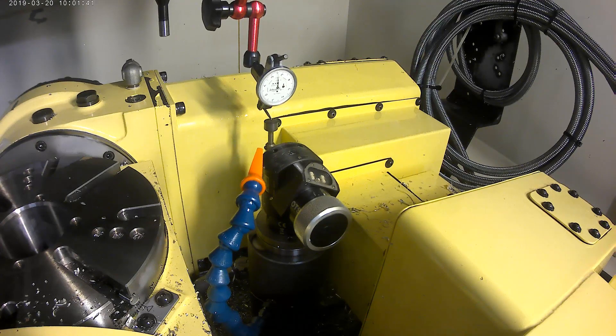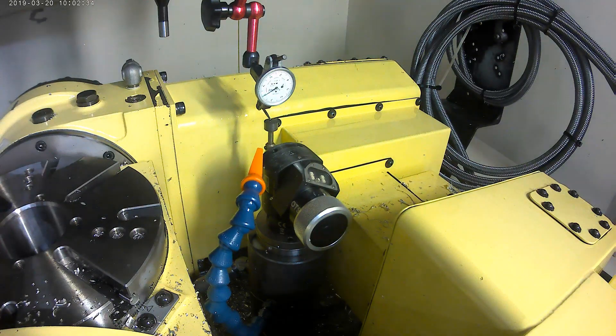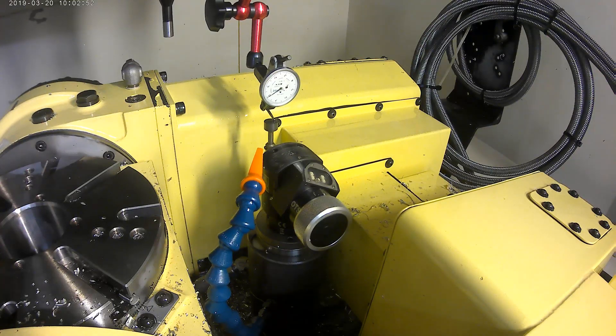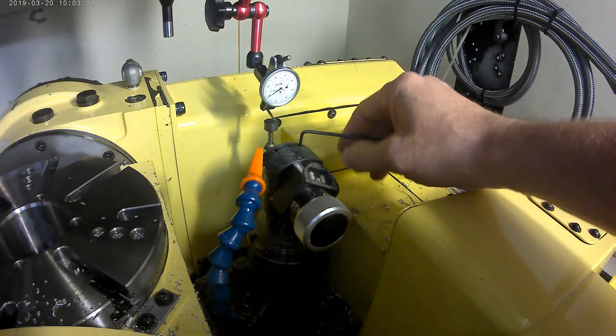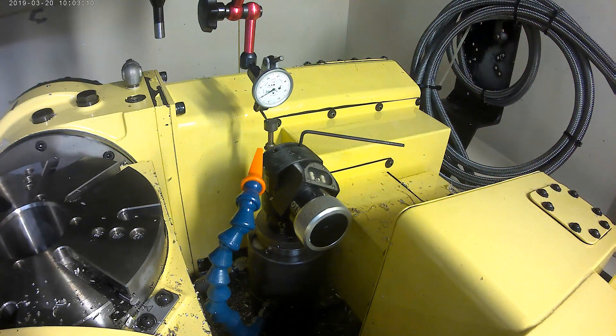Now as long as I have the indicator out I might as well do the same thing for the optical tool setter stylus. This OTS is mounted 90 degrees from what is normal, but it really doesn't matter — I just want to make sure that this thing is flat in both axes. I'm going across the longitudinal axis of the tool setter. There are two socket head cap screws: one that will raise the tip and one that will lower the tip on the front portion of the OTS. I will sweep back and forth across the longitudinal axis of the OTS — in this case the X axis of the machine — and see how flat we are. That adjustment is made with two small set screws similar to the ones in the spindle probe, right on top of the OTS. By tightening one and loosening the other you can get the entire body of the probe to roll about the longitudinal axis of the touch setter.